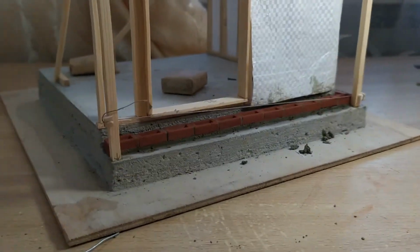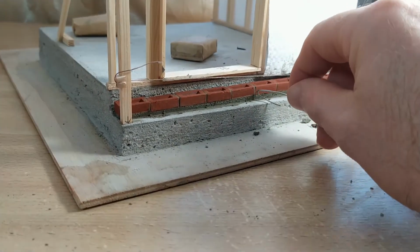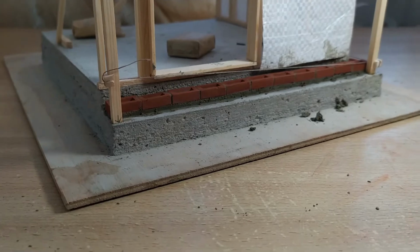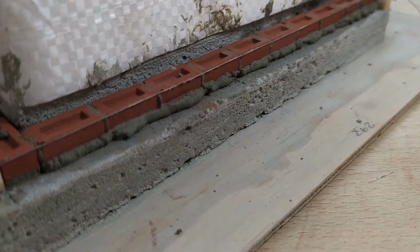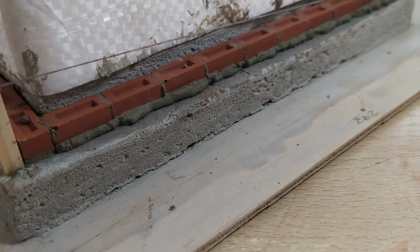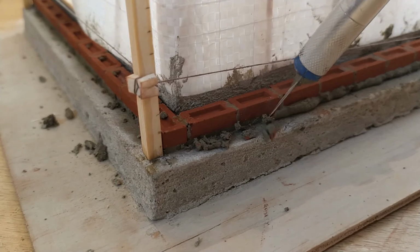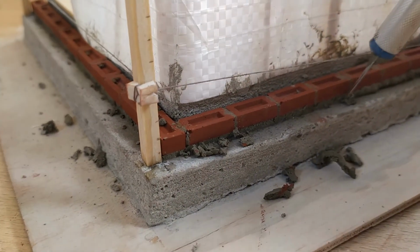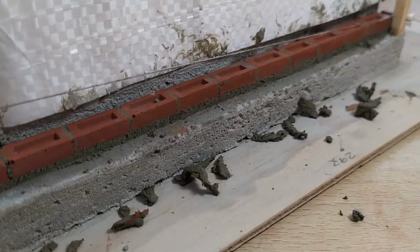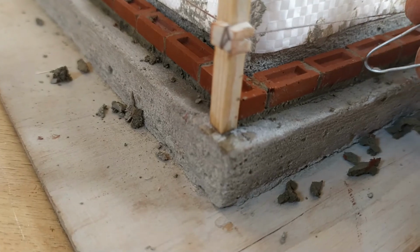It looks okay. How I'm jointing up, I've got this piece of wire and I'm coming along here and I'm basically just doing this. I'll be doing that for every single joint on here. Hopefully it's going to look okay. I'll point these up and see how I go. So what I do, I can take this line up a little bit now, like that, and then normally scrape off these, like so. Okay, that looks alright. And the lighting's terrible at the moment. Brush a little bit.